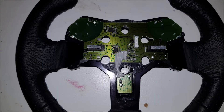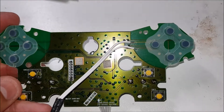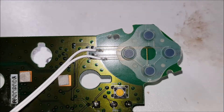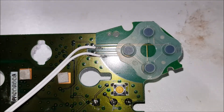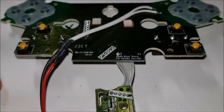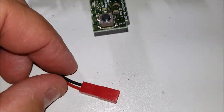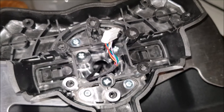Let's get started. So doing the handbrake mod for my G920, I've tapped it off the B button — there are the wire tracks for the B button. I've already hooked it up and tested it and still got signal using the pad button there, and also by connecting the open wires at the end. So I'm using, I believe it's a JST from the radio control type stuff, so that way I'll have a connection down through the shaft.